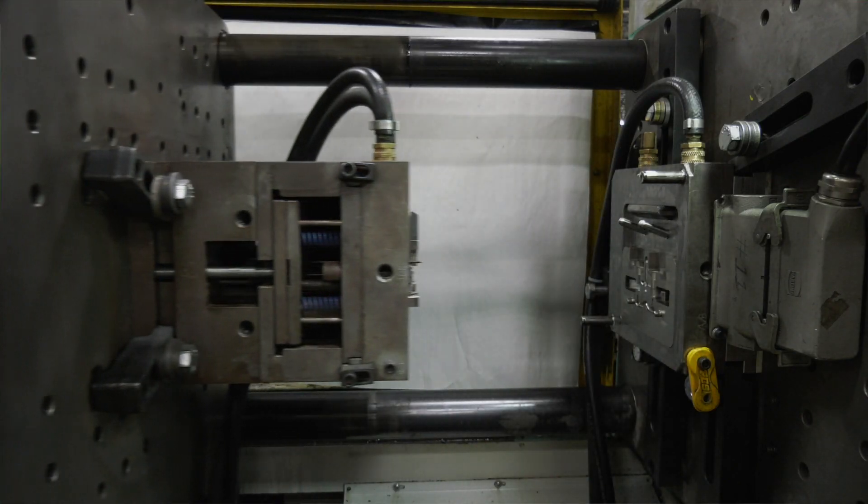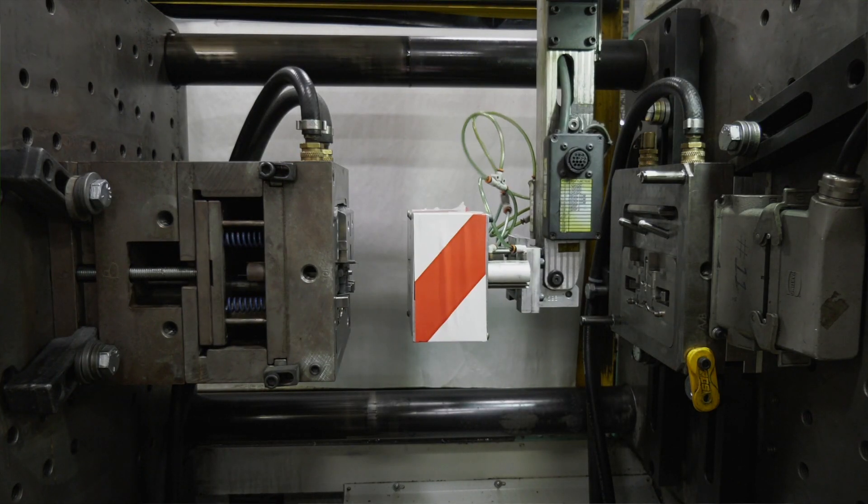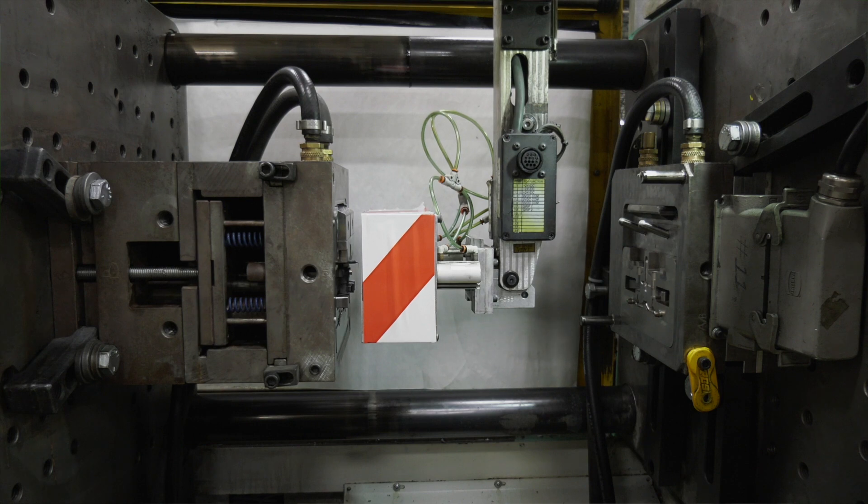The process is somewhat similar to plastic injection molding, but it takes the best out of plastic injection molding — they have been able to mix metal powder with plastic and then inject it into a die which is shaped like the part.